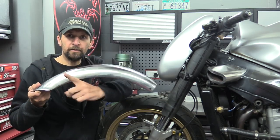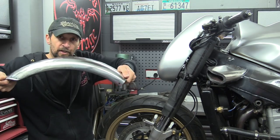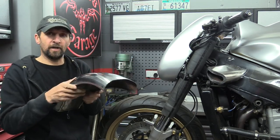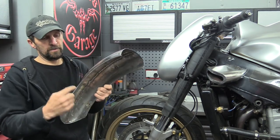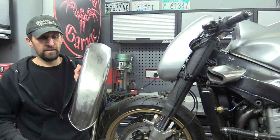is to cut little slices in it along its edge both sides, then curve it around a little bit more and tack weld those slits up. That way you effectively bring the curve in. You obviously couldn't just bend it because the sides would just flap outwards, being that this is a curve. So you've got to cheat really - cut little slots in it, then just weld them up and planish them over. The whole thing's going to get bodywork so it doesn't matter if it's got welds on it.